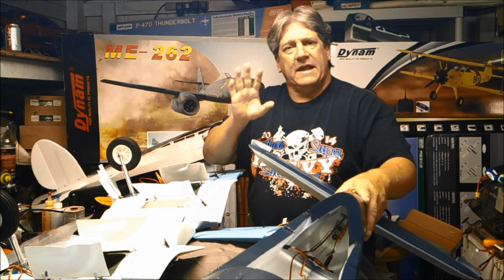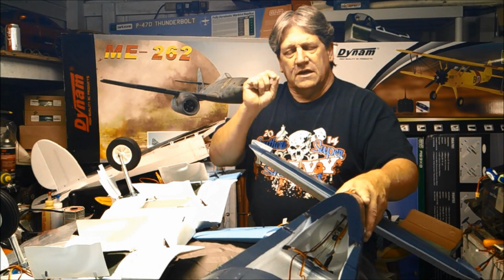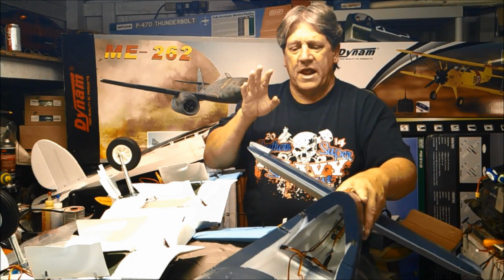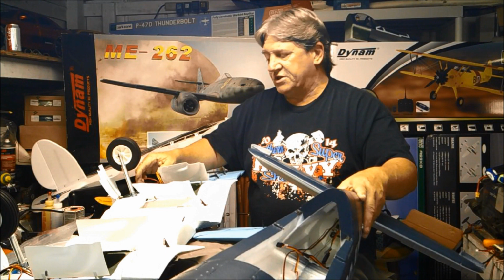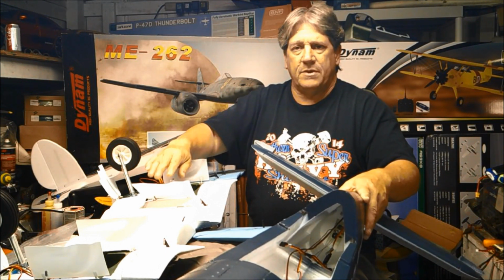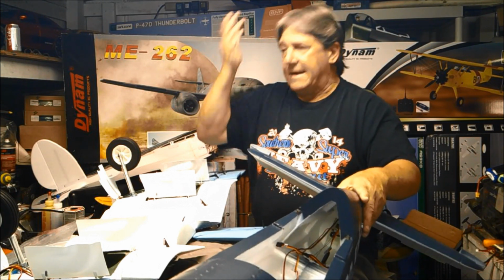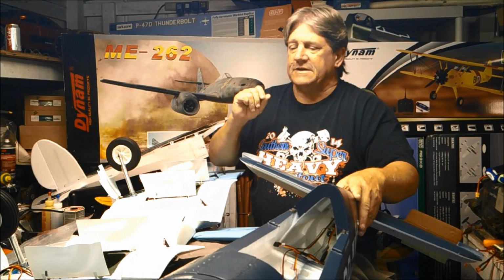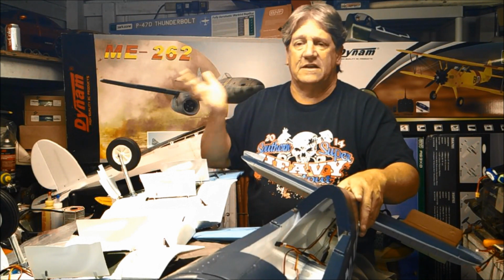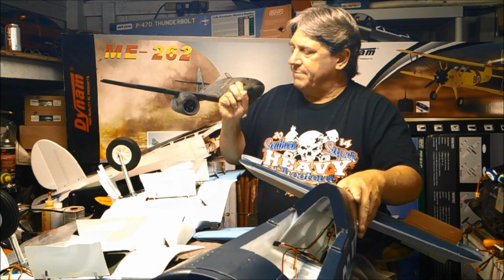And again, make sure you do not tighten those up. Put something on the thread so the nut won't come off of it, but it has to be free. It's very important that those don't have any kind of drag on them. There's been reports, and I'm hoping they fixed that by now. It was 6 years ago when they first came out with this that people were burning up the mechanism. My guess is because they were showing it off and ran it up and down 6 times in a row, overheated it and burnt it up. But that may not be true. Regardless, I'm hoping that if that was an issue they've fixed it, because after 6 or 7 years they should have come up with a better mousetrap for that. But I haven't had any problem with mine.